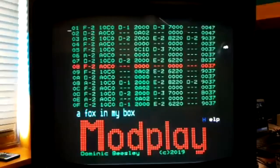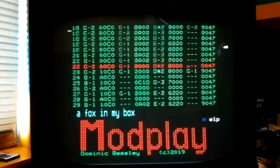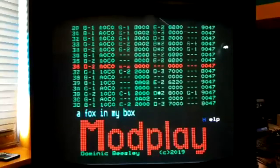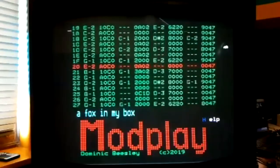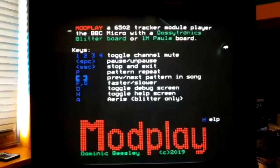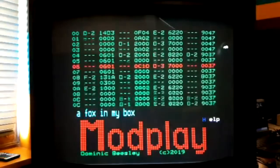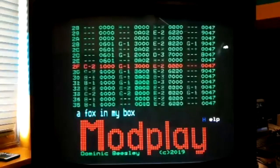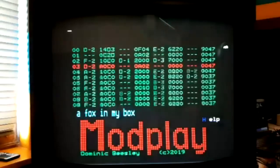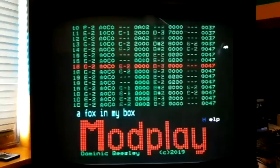I'm sure I'm even louder. So what this is doing, it's an unmodified Amiga ProTracker song that's been played by a tracker player that's written in 6502 assembler. And it can do this and it can do other stuff at the same time. So there's a few little gadgety things on here that don't really do much. But it would be possible to get this playing in the background of a game quite easily. The real constraint on that is how you shuffle the memory about, because the songs themselves are quite large, so they can be up to like a megabyte in size. You need to be able to see about 4K of it at a time to be able to get the pattern into memory, and then the rest of it's just poking hardware counters. And we'll stop this because I can't hear myself think.